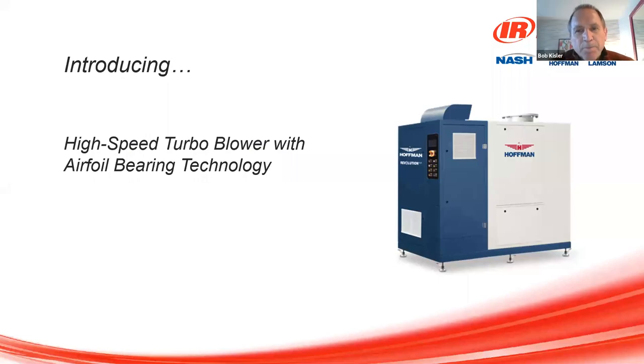You run at 35,000 RPM, which does present some things you want to look at. There are two technologies on the high speed: the magnetic, and then there's the air bearing. Over the years, air bearings initially came out about 10 years ago, and everybody put them in all kinds of applications. It's another arrow for your quiver to look at as far as high speed. So there are some limitations with any technology, including the high-speed air bearing.